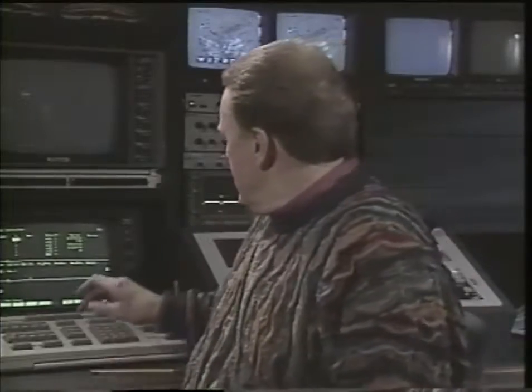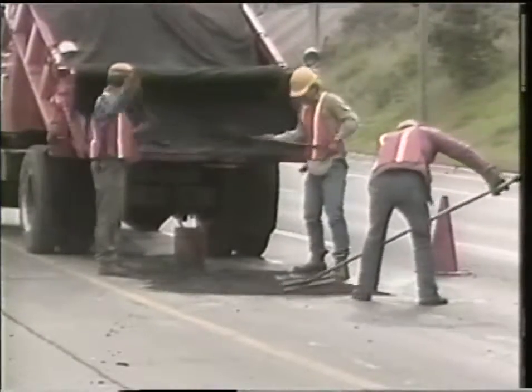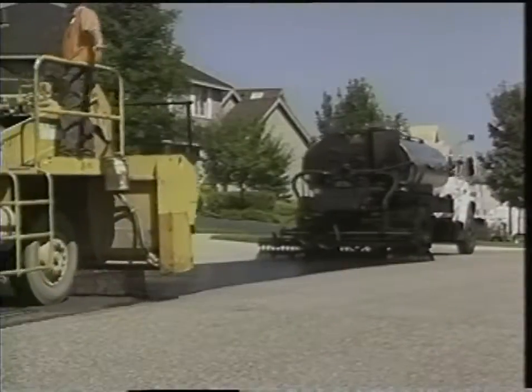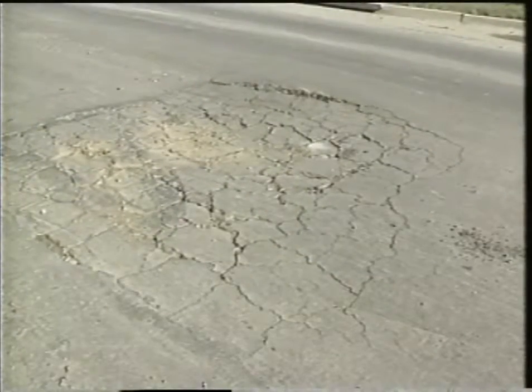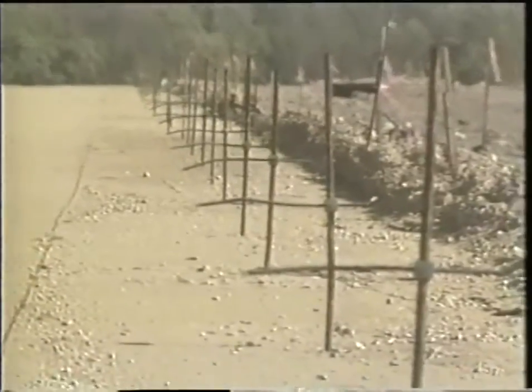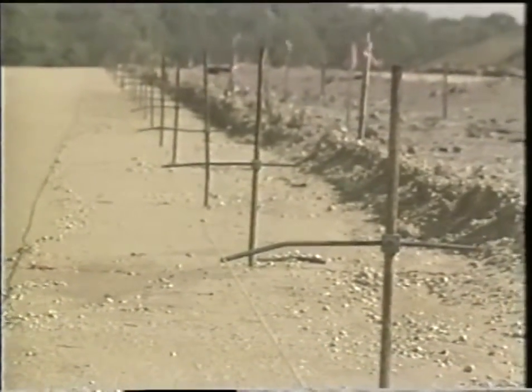Let's assume an engineer has gathered the necessary data and is beginning to plan specific maintenance projects. For newer pavements and when no traffic increase is expected, engineers are likely to recommend preventive maintenance techniques — patching potholes, filling cracks, or applying a seal coat, a thin protective layer of asphalt and crushed rock. When an asphalt pavement gets old, after 20 or 40 years of service, the engineer often decides to remove and reconstruct the entire pavement from the bottom up. It's between a pavement's youth and its old age that engineers commonly decide on an overlay.